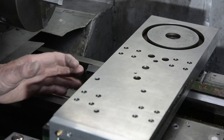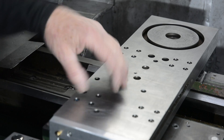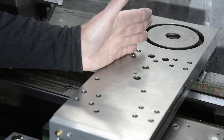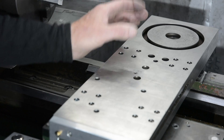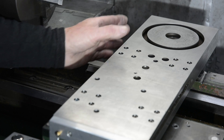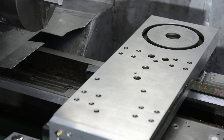Now that's not terribly important — it doesn't really affect the use of the lathe. Because what matters when you're facing and moving the slide in this direction is the direction of travel, not the angle of this edge. This edge could be over at an angle and still travel in the correct direction. The reason I take the trouble to align this edge is because it's a useful reference when you bolt other tools onto the cross slide — it gives you a reference by which to line some of those up.